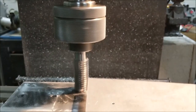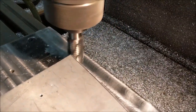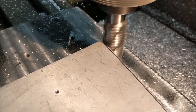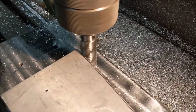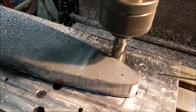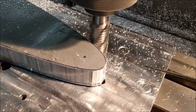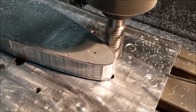I'm running about two to three inches a minute. It's taking off about 30 thousandths on that pass. Now I've got to hit the end mill with some air. Coming up on the halfway point — I wanted you to see this. You'll hear where it starts not making contact. It's starting to trim less off on this 60-thousandth pad — it's making a nice cut though.